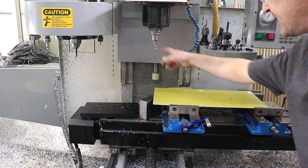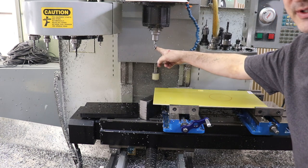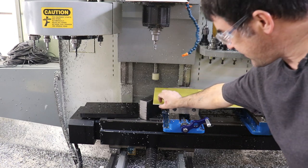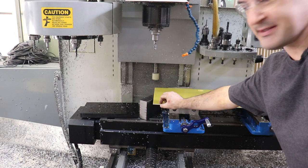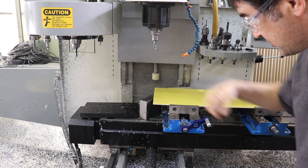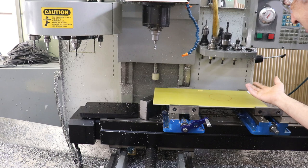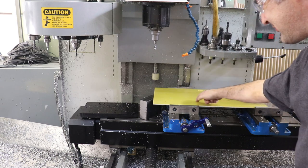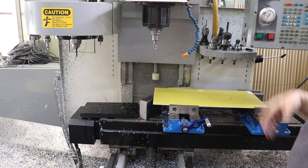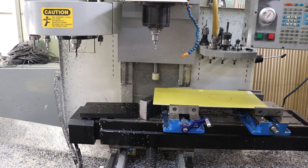on machining. So I've got an old carbide end mill here, and I'm gonna ride up onto the flutes to cut through this fiberglass with a single pass, and pilot drill with an older drill bit as well, because by the time you're done cutting a few of these, your end mill is pretty much shot. So that's why I'm using an old one, and it'll just be recycled after that. So I'll set the tool height.